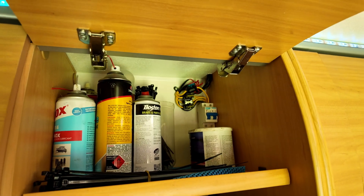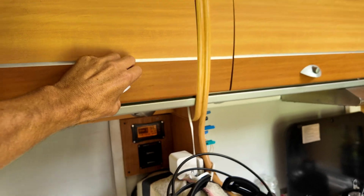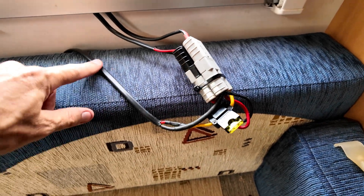Apparently you can, but I want to see what happens when the batteries reach 100% and they're both still charging - see what happens with that float voltage and whether they play nice together. Obviously you can get solar charge controllers that can talk to each other with a cable, but I've got two different brands here so they won't talk to each other. Just a quick overview of my setup: I've got the four panels up on the roof going into a breaker, then through a dual 16mm cable running down to the MPPT underneath the floor. There's the two panels outside - I just have these coming in through the window. That goes into a dual core 5mm cable running down underneath the floor, and then from there it will connect into this new MPPT and be wired into the existing system.